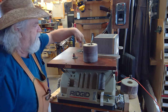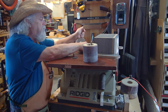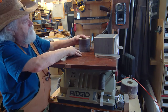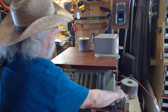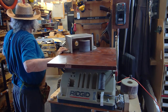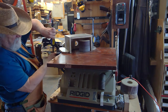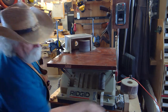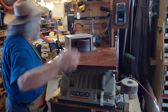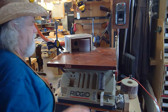To go to my four inch drum it's just as quick and easy as the six inch. I took the piece cut out from the six inch drum hole and cut a four inch circle in it, so I just put this insert in here. Now my four inch drum fits with zero clearance. Just that quick and easy I now have my four inch drum, and if I want dust collection I can very quickly put this hood in here, clamp it down, and I'm ready to go.